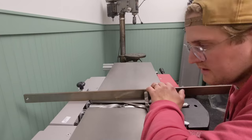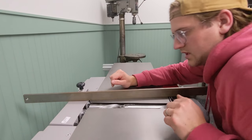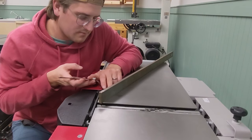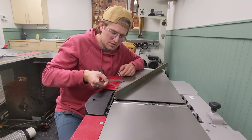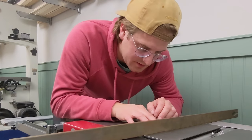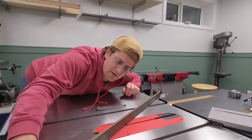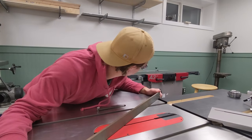Just barely squeaking 1,000. We're about 12 inches, so that's the tolerance of the straight edge. I think the outfeed is more important — 4,000. Here's 4, there's a lot of friction on 5, I don't know if you want to call that 4 or 5. So corner to corner we got 6,000 — not the best. Tight 3 right here just in the middle. Trying to make myself feel better on this one — no buyer's remorse. I'll show you the SawStop for reference: this is 1,000, barely squeaking in, getting 3,000 corner to corner. So it gives me something to reference off of. Looks like the Hammer's lagging behind the SawStop there, but comment down below and let me know.